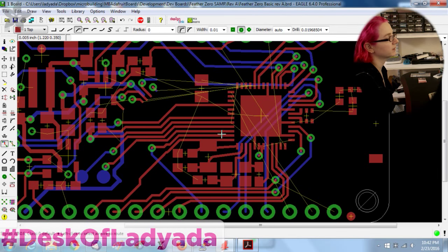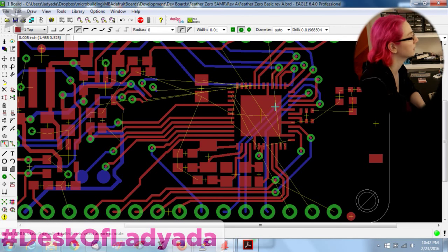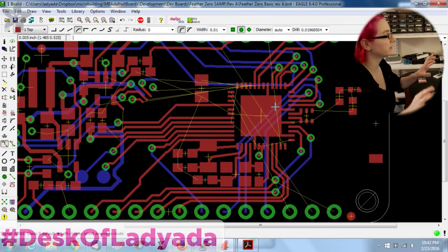Later I'll go through and clean it up — make these all nice, sized perfectly, and do a DRC. There's really no point in doing a DRC when you're first starting anyway. Get everything planar first. You just want to get your non-intersecting planar routing going on. As long as nothing's crossing, you can always adjust spacing later. Get everything planar and then you can move things in chunks.